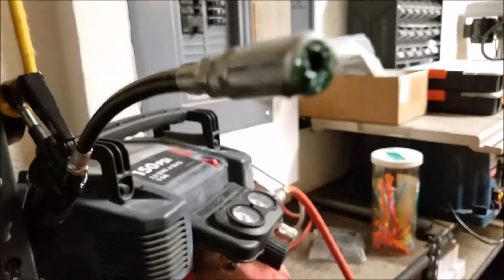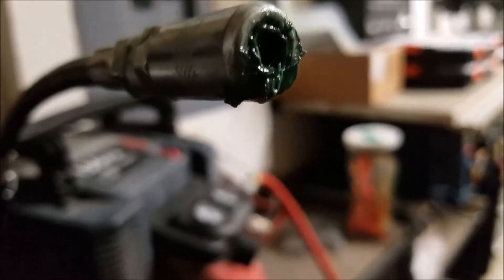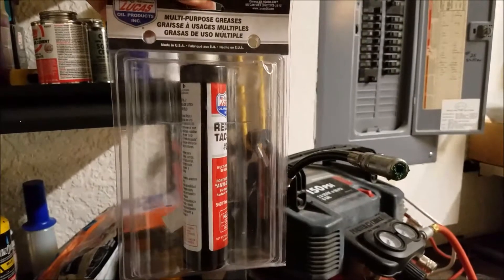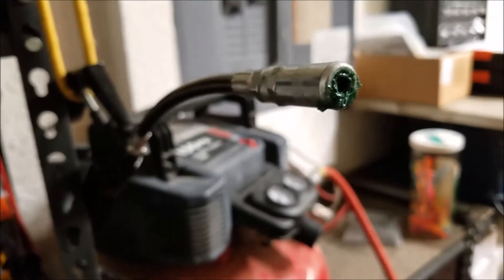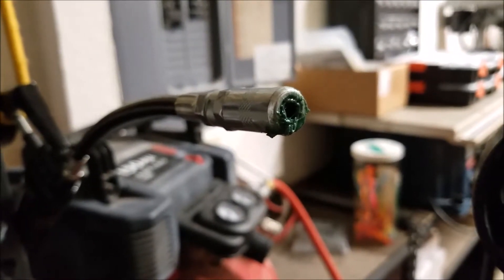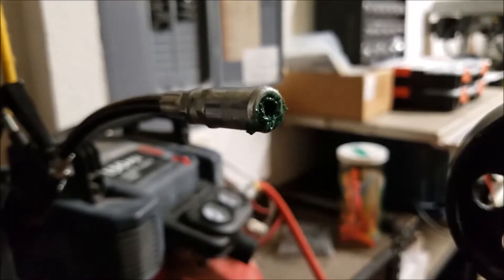What kind of grease do I use? I literally just go to Home Depot and buy generic multi-purpose grease — it's the same stuff that comes in those little packages. I already used up the green stuff and only have the red sticky stuff left, but I don't do anything special. Just generic multi-purpose grease. On a commercial CNC that might not be the case, but I haven't had any problems using it on ball nuts.